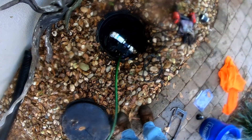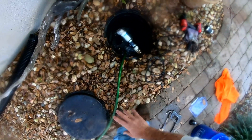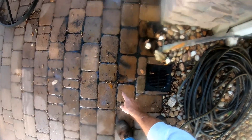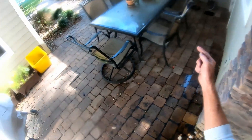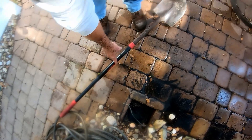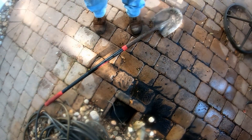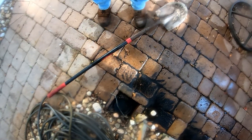Okay, so we figured out what's going on. Everything's working great: we've got a new pump down there, line comes up, comes out, goes over here. But it looks like the paving company added this catch basin and hooked it into the inch-and-a-half pipe that we have running over to that catch basin. It should still work — and of course it does work — but we need to clean that discharge line as it goes out to the lake. The homeowner confirmed the paving company did add a catch basin right here, tying it into the system, and that created the problem and the blockage.